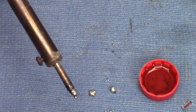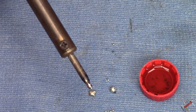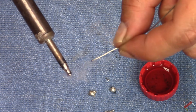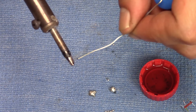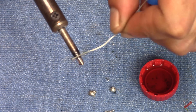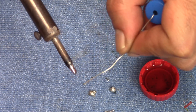It's about to cool down now. I like to leave a lot of solder on my soldering iron tip when it cools down, just as a protective measure against corrosion and to stop it from getting dirty again. In this case I forced it to get dirty. I'm just scraping some of the excess black gunk off there.